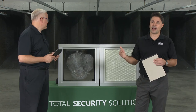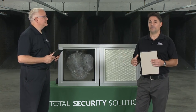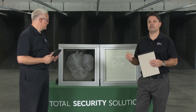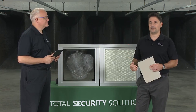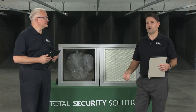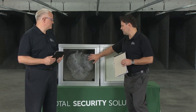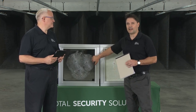If you go up to Level 4 or 5, you'd be in the glass clad polycarbonate ranges, but that brings limitations with counter systems. They're more expensive, harder to work with, thicker, and heavier — so you have to make sure your millwork and adjacent walls can handle the additional weight. This LP product is almost half the weight of a glass clad product.